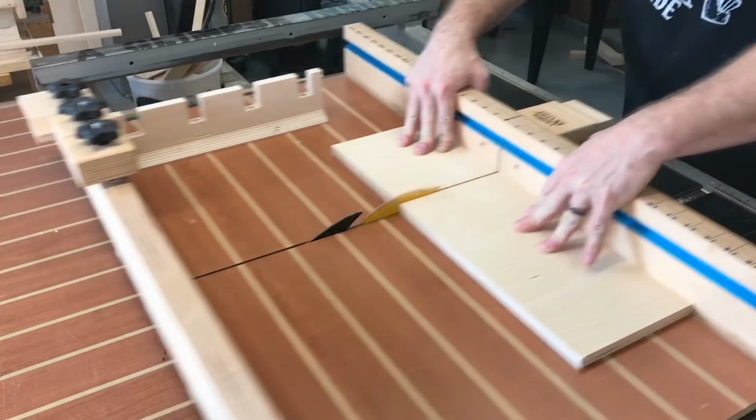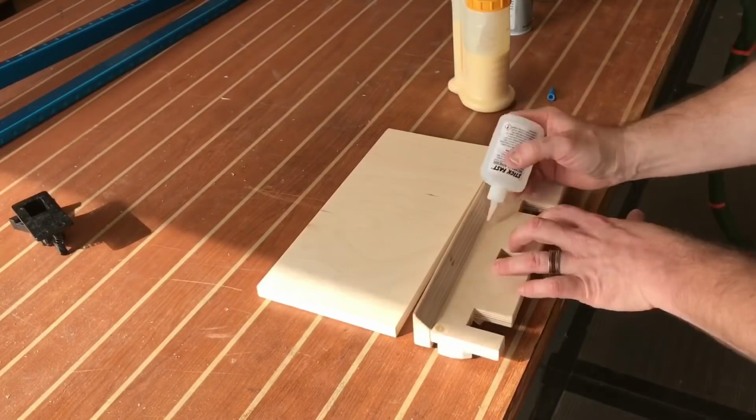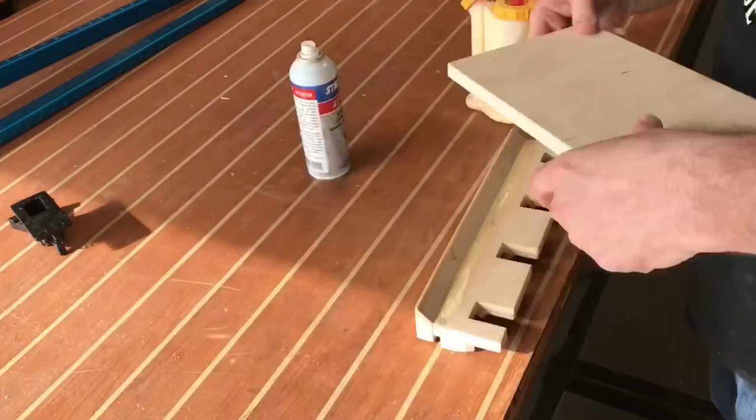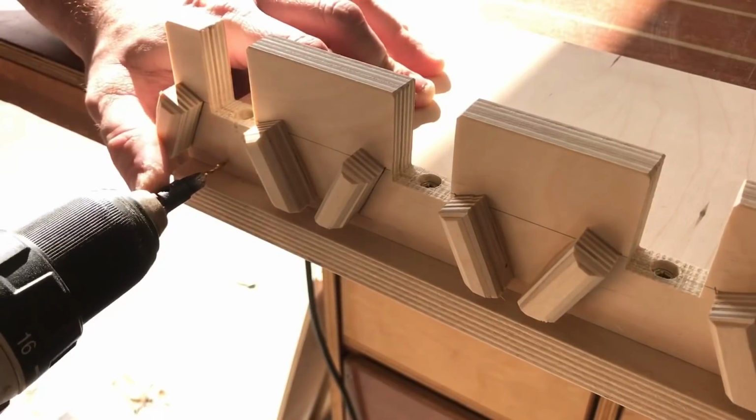So when building this bracket, I got a little overzealous and thought about the bracket system first, more so than how it would attach to the wall. And in doing so, I have to build the French cleat in kind of a backwards way. I have to attach a separate piece vertically to that 45-degree angle piece, which should be fine.